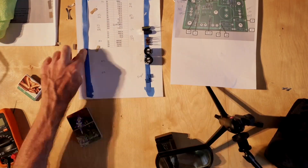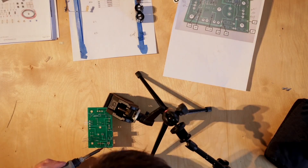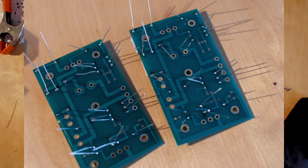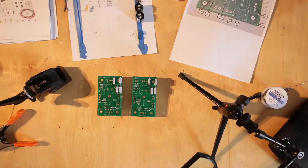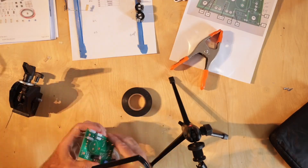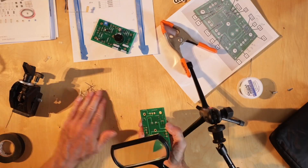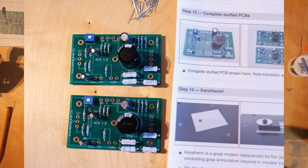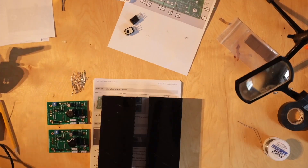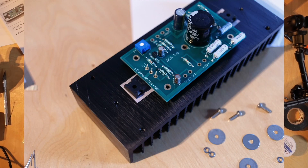The first night they built the first one and it wasn't quite going to plan — because Robert made a mistake. It didn't work right off the bat because he shorted the input on one channel, the RCA, which is easy to do because the pin and the surround are very close to each other. If you put a little too much solder into the pin, it'll just bridge the two. He didn't see it, but it was fairly easily corrected.